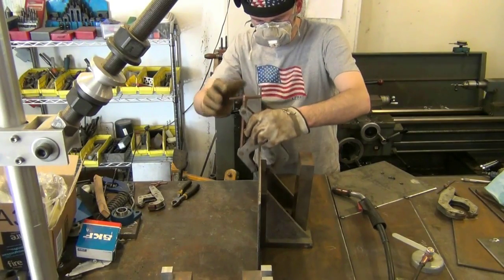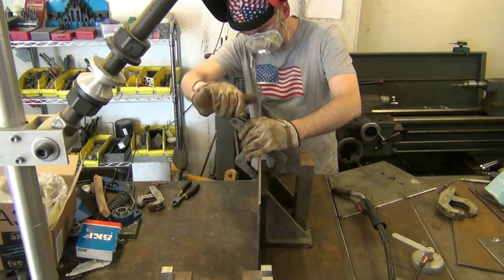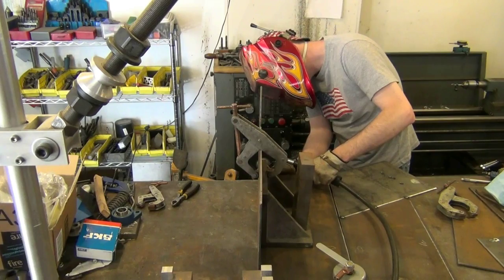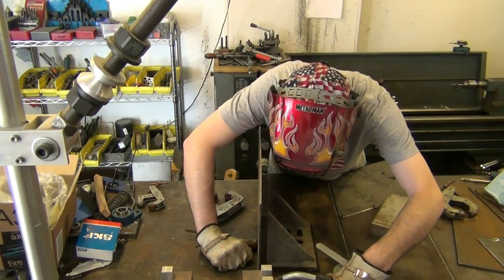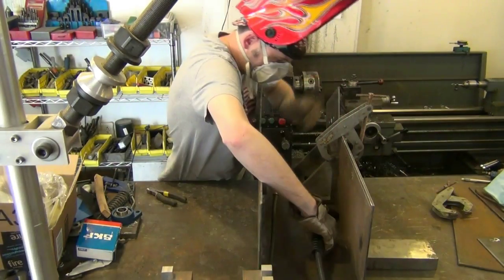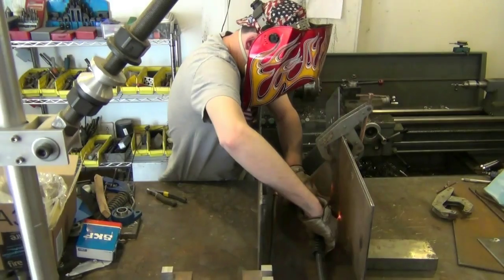I sit an angle plate on the top plate of the inlet chute and then clamp a side of the inlet chute to that angle plate. This will keep the two parts square and stationary while I tack weld them. Typically only two or three tack welds are necessary to hold parts in place. Tack welds are used because they are fairly easy to remove in case you need to realign parts. They are also used to give the entire assembly enough rigidity to keep an accurate shape during welding.